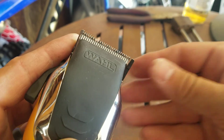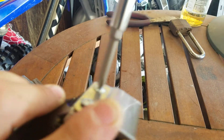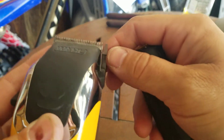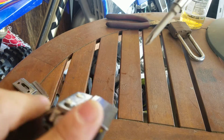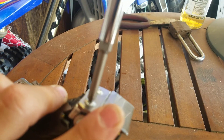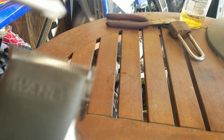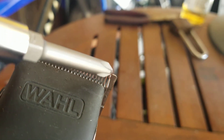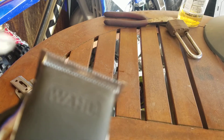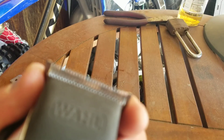Once I get that, I'm going to tighten it up. I'll do one side at a time — do this side first, get it kind of tight, then bring that over and tighten up the other side. Just do a little bit at a time so you don't torque it down, because then it'll come loose. Your goal is to have that small little one riding right on the inside edge of the fat one, and your second blade should line up on the first skinny blade.